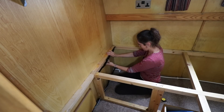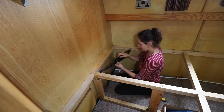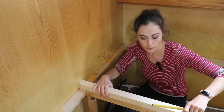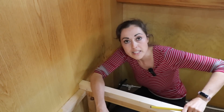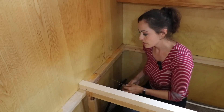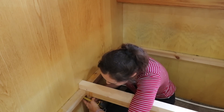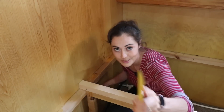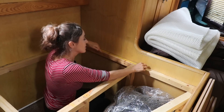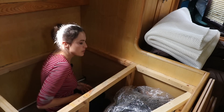This is also a little bit too long — about an inch too long — so I'm probably going to have to shave a bit of wood off the stud here. I want to keep as much strength as possible because there's going to be a lot of weight being lifted on and off. I'll cut a piece for here and one for the other side. I've got a 44mm squared stud which was flipping expensive — I can't believe how expensive wood is these days. I bought that so I didn't have to plane anything down. This gap here is actually a little bit bigger than 44mm so we'll be able to slot it in nicely. On the other side though, we'll probably have to shave a little bit off.